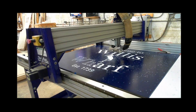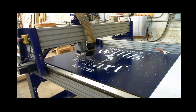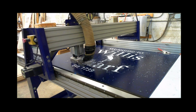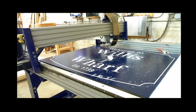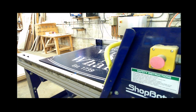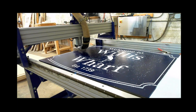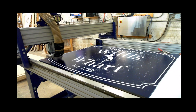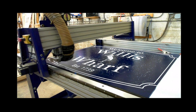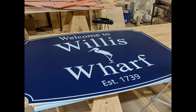You end up with it cutting a little bit here, then jumping over there — I got a video of it cutting and it looks a little funny because it jumps around. But it did a nice job. I used the Amana Spectra-coated bits. I used a down-spiral eighth-inch for the detail and learned my lesson — the down spiral makes the chips pack and fuse. If I'd thought about it I would have used a regular straight bit. I used a quarter-inch straight Spectra-coated end mill for the field and it worked great.